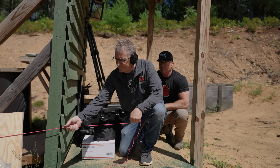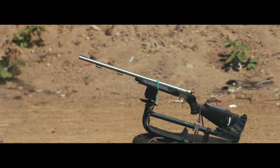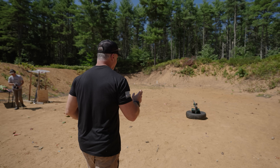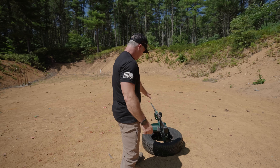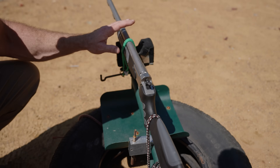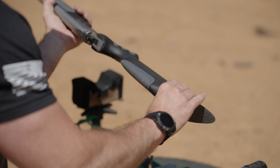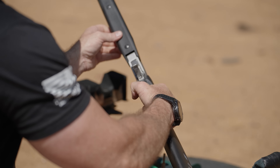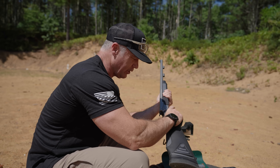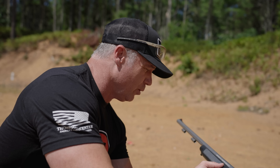Gun's hot. The gun is still in one piece. What's interesting is the gun has jumped out of the cradle — definitely more pressure here. You can see increased cracking in the stock. There's no bulge in the barrel at all. This is just continuing to weaken the stock, which is supposed to absorb the pressure. There's no visual damage to the tang or grip area — no breaking around the stock. The hammer didn't rebound or cock itself, so no excessive pressure came out the breech plug, and no bulge in the barrel.